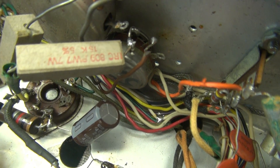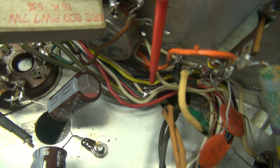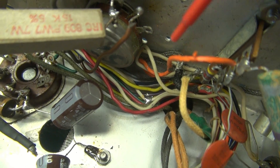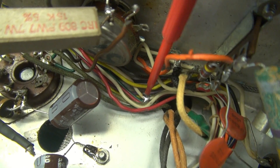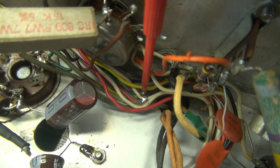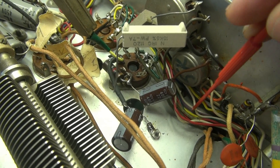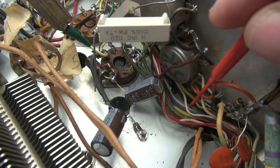As I was cleaning up the connections on these bias pots, I looked down in the harness and found a big glob of solder melded right into the insulation of this white wire, with a purple one underneath it. There are solder globs in here which could potentially short these wires out - another thing to clean up. The solder globs are gone now, and luckily it did not melt into the insulation - it just appeared that way. That was a good deal.